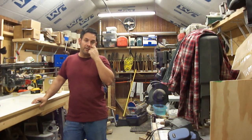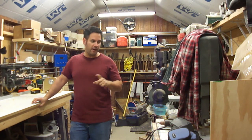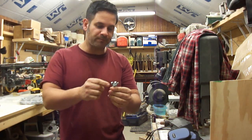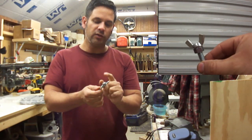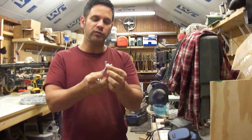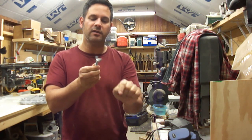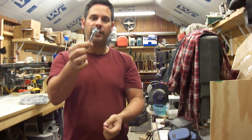One of the things we need to do is think about our spur drive — I've got to drive this thing from the headstock somehow. Here's what I'm going to do: take a carriage bolt, cut it off, use a wing nut, grind the wing nut flat, put two edges on it, and grind the threaded tip into a point. That way I'll have a homemade spur drive to fit in our lathe chuck. Let's go take a look at that.